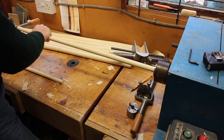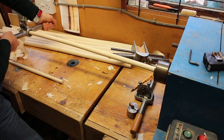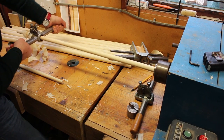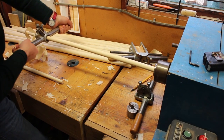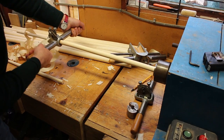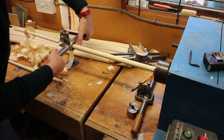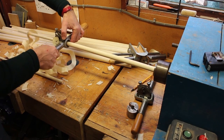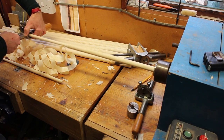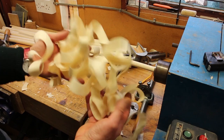First I'm going in with a half-inch rounder, just taking off the excess down to half an inch, taking it to my first pencil line. I'm definitely getting a better cut with this sharpened blade. You can tweak these rounders and really get them quite good if you keep at them. I'm coming up to my first little marker so I'll stop when I get to that. I can see the shavings so I know the tool is fairly sharp.